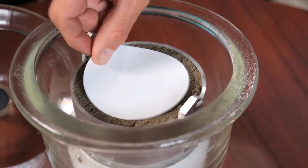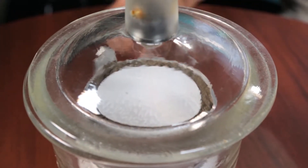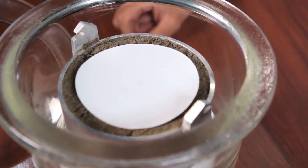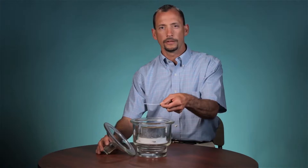The filter paper method is a relatively old method for measuring soil suction or water potential that's still pretty commonly used in geotechnical engineering. With this method, a piece of filter paper is sealed in an airtight container with some soil and the suctions of those two are allowed to equilibrate. If the filter paper is in contact with the soil, it equilibrates with the matric suction of the soil, and if it is suspended above the soil, then the total soil suction equilibrates between those two.